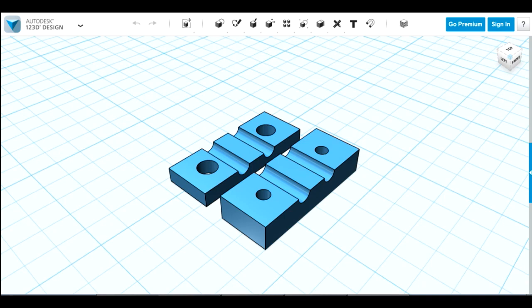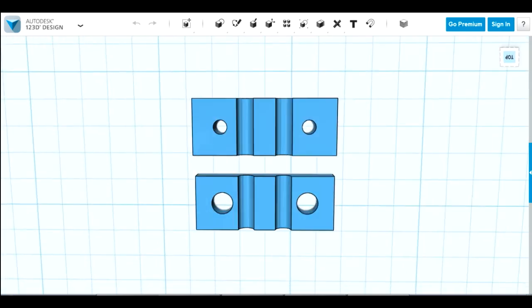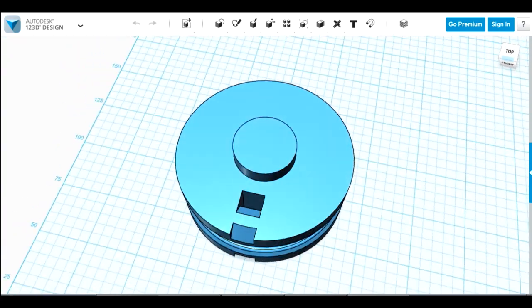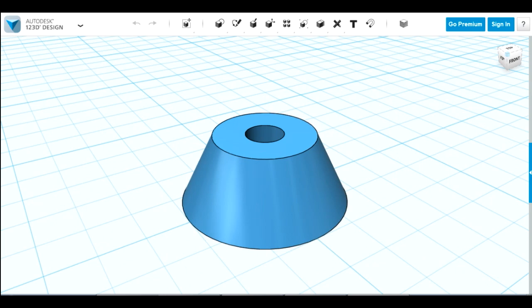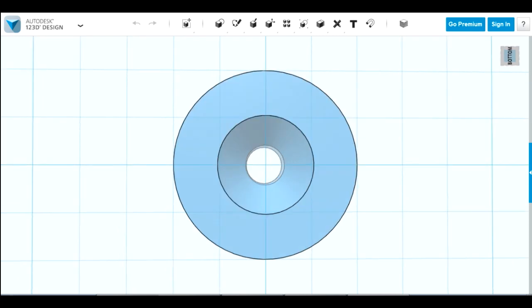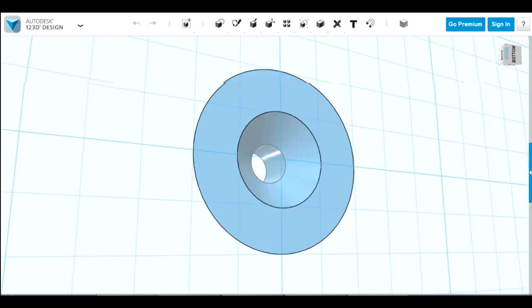Here's the CAD for the clamp pieces for the nylon 3D printer filament — two channels and two screw holes, with the bottom screw holes slightly smaller so screws go straight into the plastic. This is my hub piece that takes the tube over the hips, with a channel for the cable tie and a knob on top to adhere to the plate. And here are my stoppers for the Teflon tube, acetone-welded onto the tail section. They're cone-shaped inside so the Teflon tube homes properly and the nylon filament glides through the 4mm hole without rubbing on ABS and wearing out.